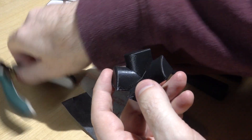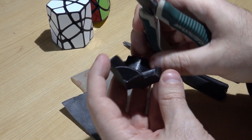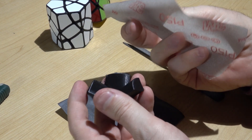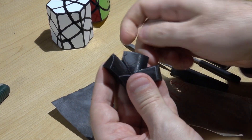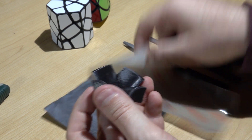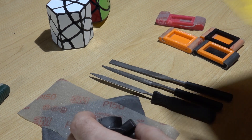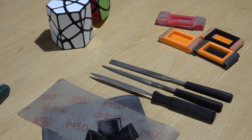The first thing I do when I grab a piece — once I've taken off the support material — is use something like a small needle nose pliers or small clippers to clip away the support, and everything just breaks off very easily. A lot of people use sandpaper and it does a good job, but what I like to do instead of using sandpaper first is use these little needle files. You can get these in packs at the hardware store or hobby stores, usually in packs of eight or ten for about ten dollars.